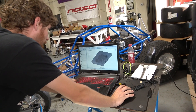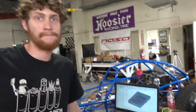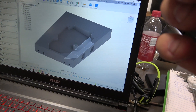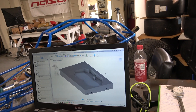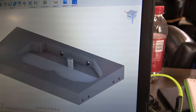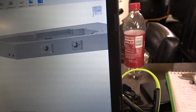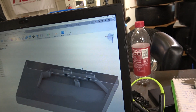Let's go to your oil pan real quick. As a note, guys, there has not been any lightening in this — it's largely a solid block. We're going to show you the relief for where the oil is in the crankcase and also where it's going to bolt in the front and the rear. Go ahead and illuminate the surface on the inside. These two faces right here — rotate a little bit so we can view that better. That opening is effectively the inside of the pan. This post right here gives us a little extra strength — we're picking up another bolt hole point kind of in the middle. These holes here have two tapped openings, which you can see — that is going to be where the pickup points for the oil will in fact bolt in.